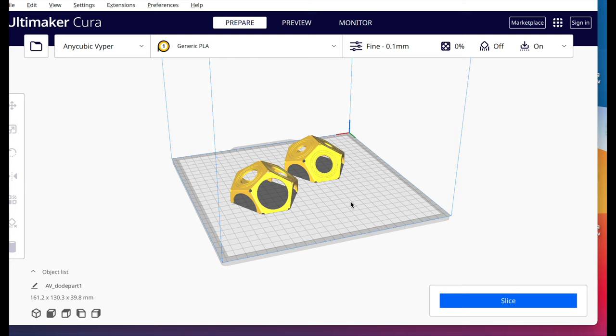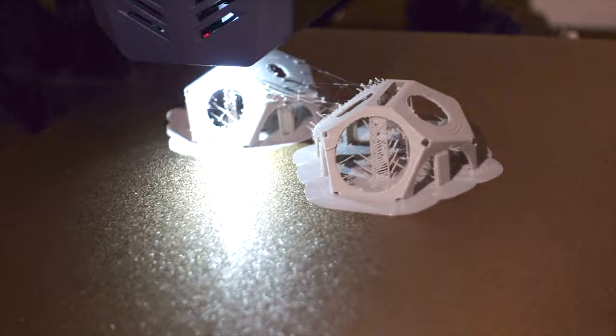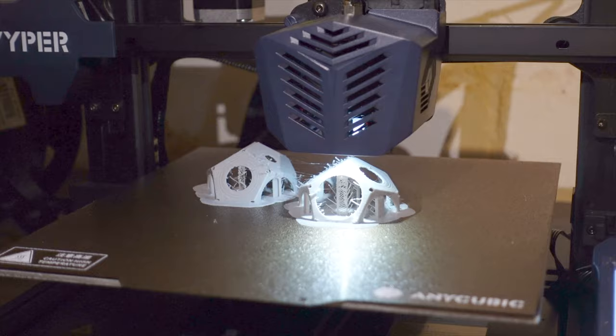Let's make one. Now the Romans would have used the lost wax casting method. With painstaking care and precision, they would carve these out of wax. I am not nearly that skilled, so I'm going to use technology. With the help of a 3D printer, I was able to find a digital file of a Roman dodecahedron and print it in PLA. The PLA is basically a plastic — it's not the same as wax, but it still melts out and burns out, so I can use the lost wax casting process. But it's lost PLA.